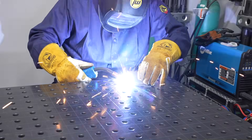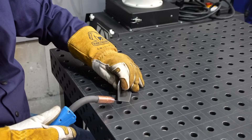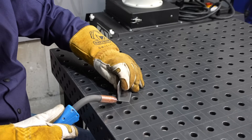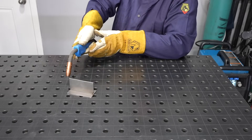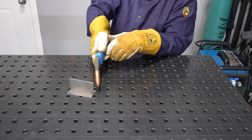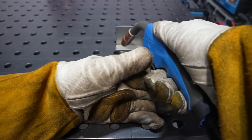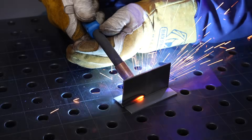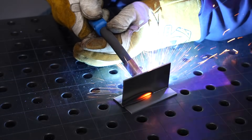I'll go ahead and tack up a T-joint since that's what we've been talking about. When I try to do this freehand, it's very difficult to control all that movement and keep it from wiggling around. Sometimes you have to do that and just do the best you can, but if you can use another hand to prop up, that's going to help quite a bit. I'll triangulate between an elbow and my hand, or just put my hand flat to rest on and slide across. That makes a big difference in keeping your stick-out, angle, and positioning all consistent.